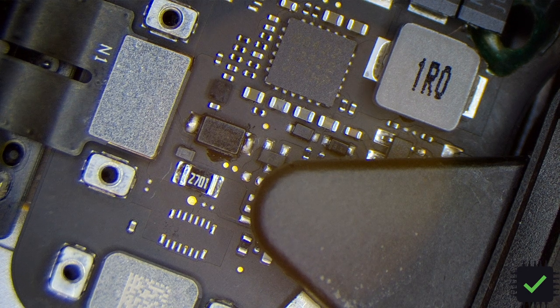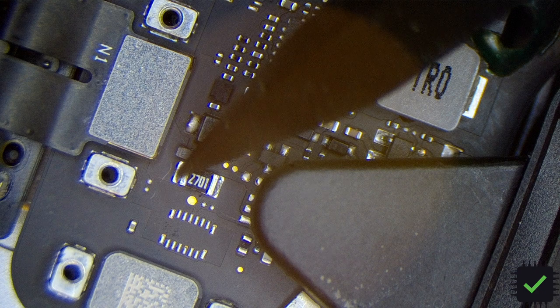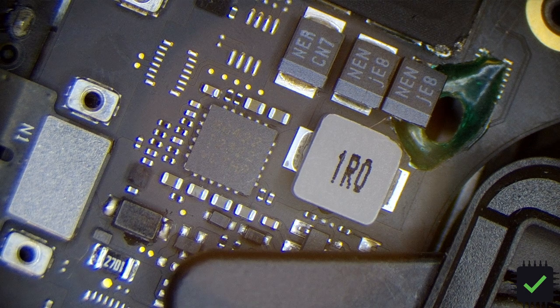So there's some other underlying problem there. When I measured with my 96-watt adapter - the MagSafe USB-C to MagSafe plug - on the diode it was showing 20 volts, and on this resistor, the other pin for the MagSafe, it was showing 1.6 volts. I'm going to try to inject 20 volts here, remove this diode, and check where it's getting hot. Maybe I didn't clear out the short all the way - there might be another short somewhere else.